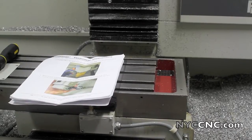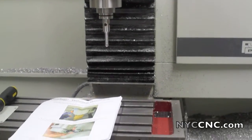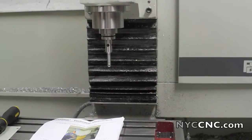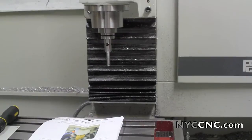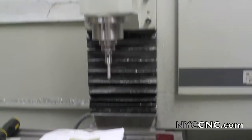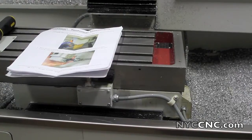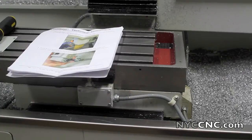First thing I noticed is that you need to block the Z-axis up on a piece of wood so that it doesn't fall when you detach the motor. To do that, you don't want any tools in the spindle, nor do you even want the TTS-R8 collet which protrudes through the spindle nose. I'm going to take out the whole drawbar assembly and block it up. I've also got the table in a good position — basically all the way forward and all the way left near the limit switches.